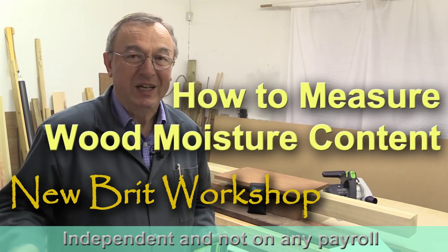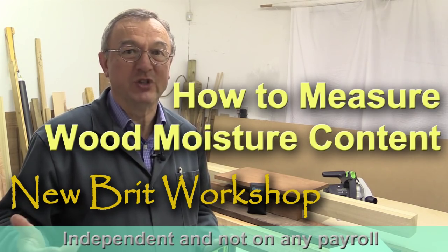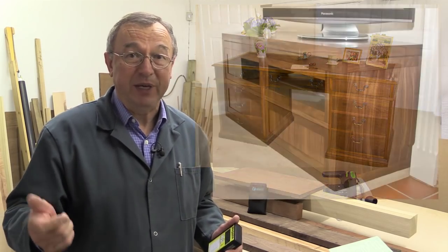When I start my various woodworking projects, I always think about things like the moisture content of the wood, whether it's going to continue to move or distort after I've started making things. For really special projects, like the desk you may have seen me build and the TV cabinet I've made recently, I've bought the wood well in advance, kept it in my workshop to let it dry out slowly, and even taken it into the house and left it there for about eight weeks — before I've started any machining, before I've tried to get it flat or square. That's been my non-scientific way of trying to offset the possible effects of wood being at the wrong moisture content.